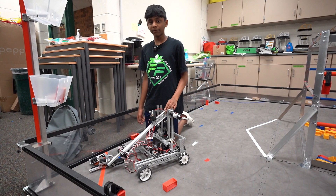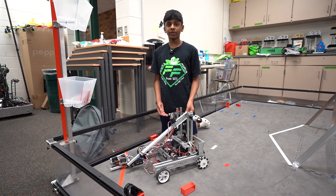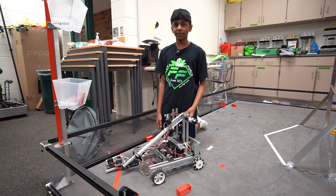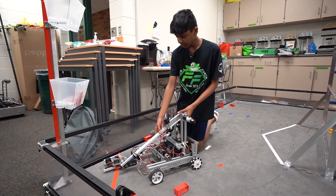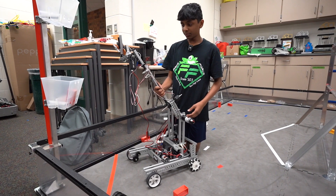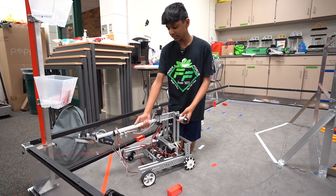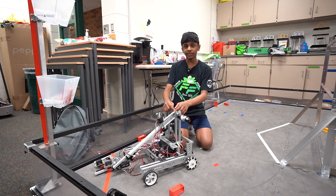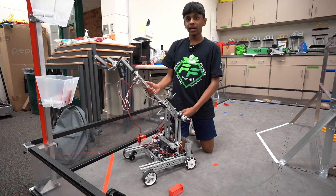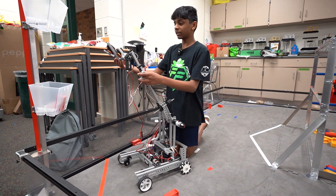This has been our robot for Robot in One Week. I wanted to share a few important things that could be useful for your robot, and also things that should have been done differently. Since we have to raise our arm really high, make sure the arm has enough torque. You should add a counterbalance to the end — it makes it a lot easier to raise because there's an equal weight on the other side, so you can reach positions.